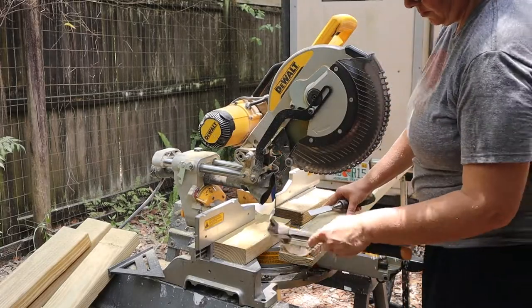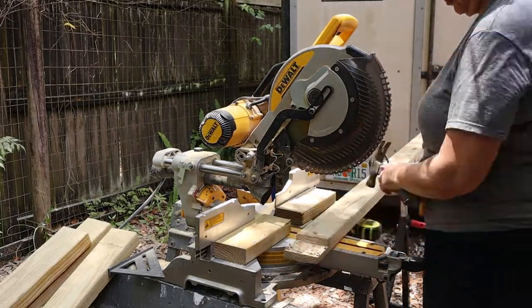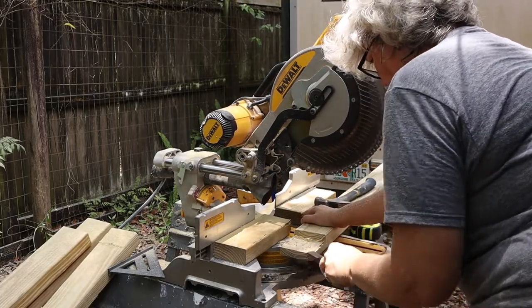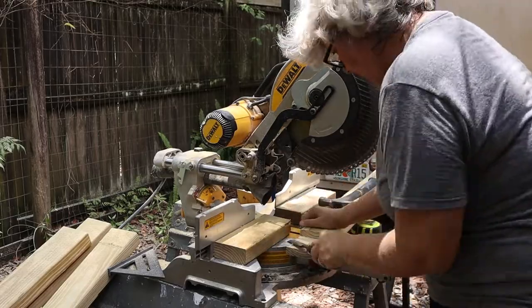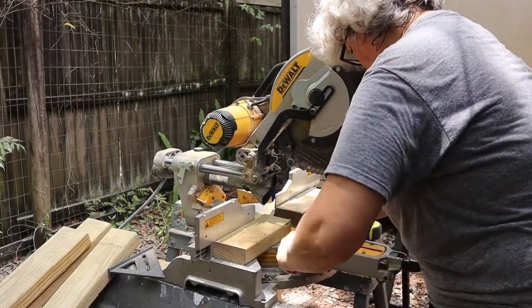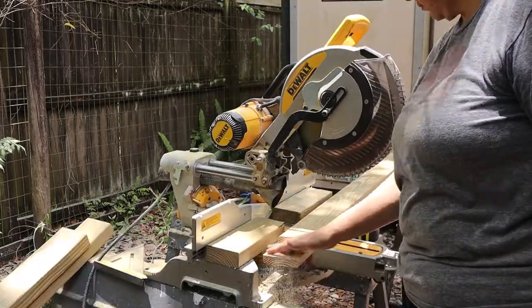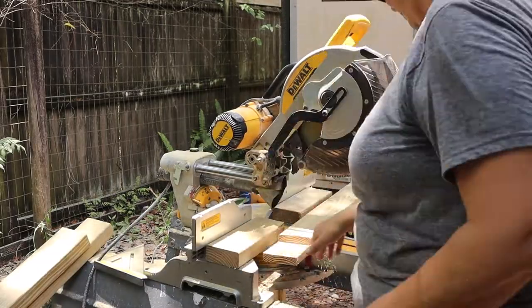You should be able to remove most of the material this way, other than small nibs at the bottom of the board. Now you can take your chisel and slide it across the grain to smooth out any bumps. If you're using hardwood species, you may have to use a rasp to get a cleaner bottom. Usually we start with one top and one side so that we can test fit the pieces together after they've been cut.